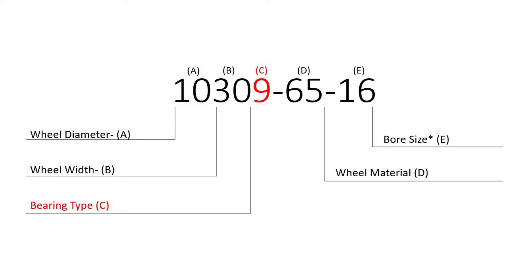Exhibit C, you will find the ball bearing type. This can vary from precision ball bearings to roller bearings to precision tapered bearings. We work really hard with our customers to retrofit them with the right products, and that includes ball bearing types. If you're looking for something with a much more free rolling range, you would go with a straight roller bearing. If you're looking for something a little more compact and sturdy, you might go with a precision tapered. It all has to do with your application.